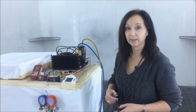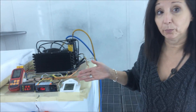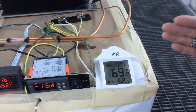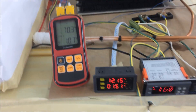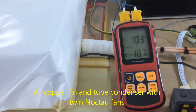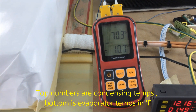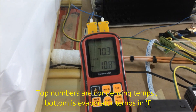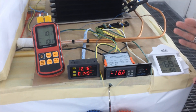As we begin our Cold-Ai test today, I want to show you what our gauges are telling us. Here we have our temperature gauge. Right now in our environment as we begin the testing, it's 69 degrees Fahrenheit. Our condensing unit on the Cold-Ai refrigeration system is also operating at right about the same temperature — 70 degrees. So we've got that hooked up so that we can see how it operates as the heat increases up to 120 degrees for our test.